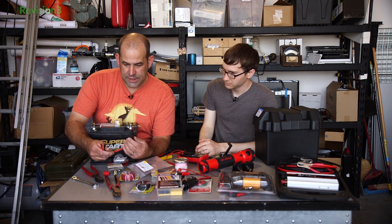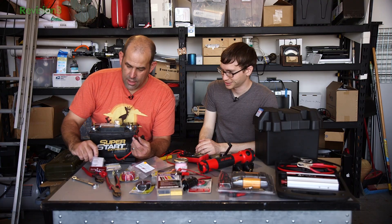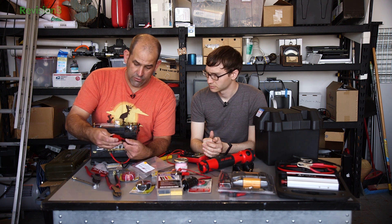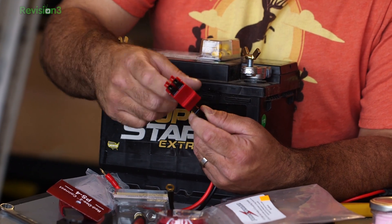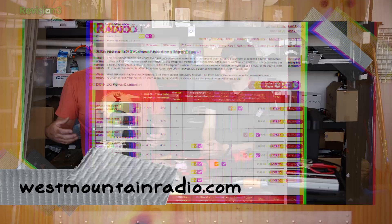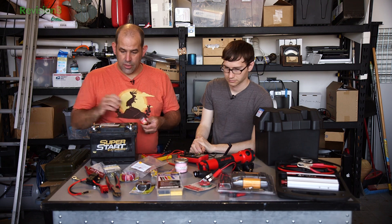The super cool version of this project is to use Anderson's PowerPole system — a PowerWerx adapter that's pre-wired with 45-amp fuses. It's a little expensive to get into; the crimper for these connections is $40. West Mountain Radio does incredible power boxes with their Rig Runner units, which are all pre-wired and can manage charging. But we're going to keep it simple with stuff you can find at your local hardware or automotive store.